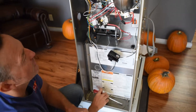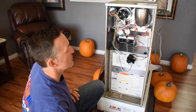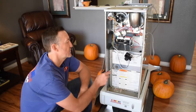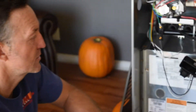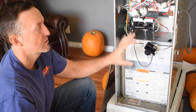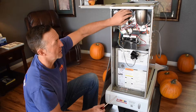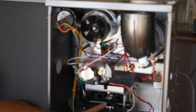It's all reinstalled — you're good to go. Now you're going to reconnect power to the furnace by plugging it in or reconnecting it however you disconnected it, and then you're going to test run the appliance. You may have to put your blower door back on to close the blower door switch. Leave the burner compartment exposed as long as you have an open combustion furnace and test run the appliance. You're going to notice it goes through a sequence — the inducer motor comes on first, you'll notice the fan, and then you're going to see a glow.